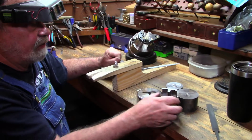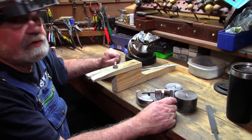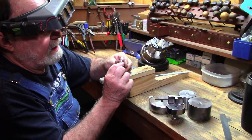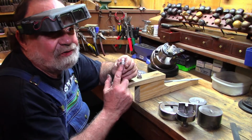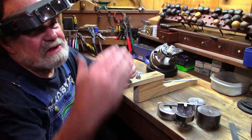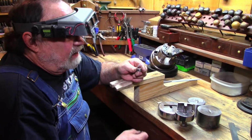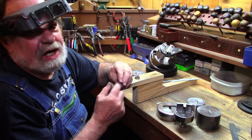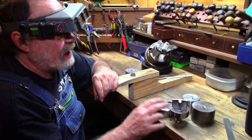This time we started from the cutting dies, which is going to make it a lot better, because before, on this first run, I made the stamping dies first and made the cutting dies later. We couldn't get them to match up correctly. So in other words, there's a lot of hand cleanup and hand trimming involved. So hopefully we can cut that down a lot.